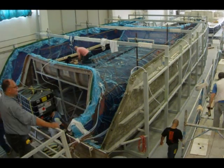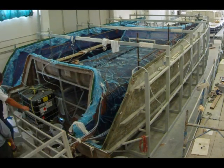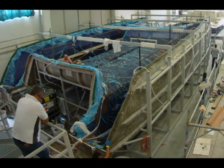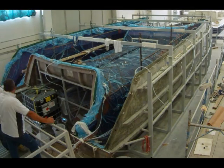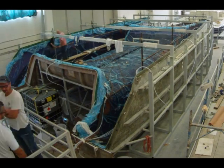Then a sort of large plastic bag is laid over the fiberglass mats on the hull. The air is sucked out, thus creating a vacuum, which results in the resin then being sucked or injected into the fiberglass carbon and core cell.